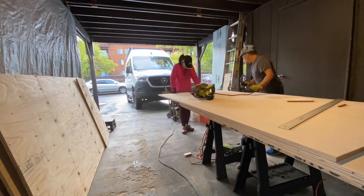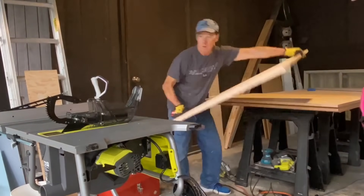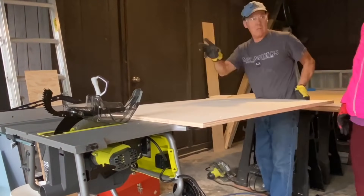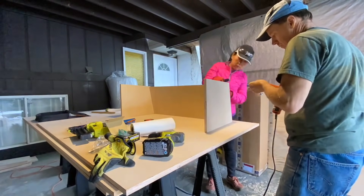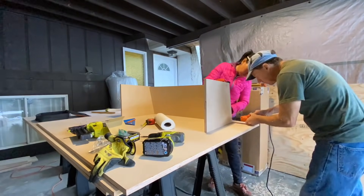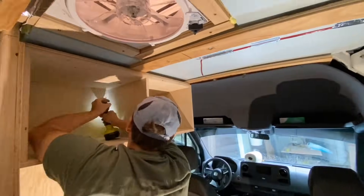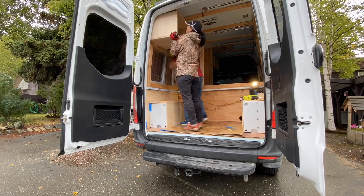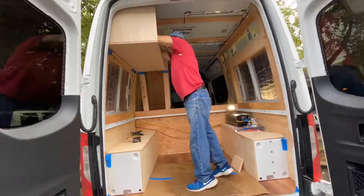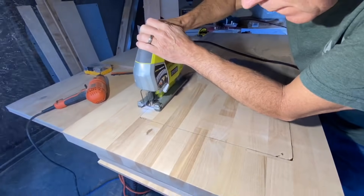Sanding down the material to box those in. The table saw came in very, very handy — it helped keep everything square. Building some cabinets here — these were a real challenge, because nothing is square in the van, as many people will tell you. You've got to hold it up there and recut maybe. But using a scribe to draw out on a tester board and cut that piece first to see how it fits is really smart.